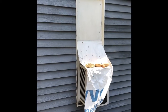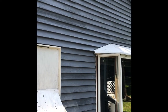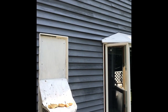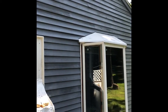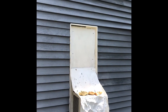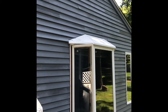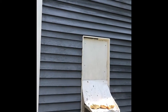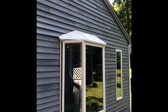I did ultimately decide to do a second coat — definitely the right decision, though a lot more work. The whole job wound up being about two gallons, maybe a little bit more out of the third. I put it on pretty liberally, and you could probably get away with two gallons for this size area. This wood was horrible — it soaked up the stain like a sponge. For about $80 and a little time and elbow grease, you could solve that problem yourself. Take your time, use good brushes and good materials, and you'll be happy with the results.